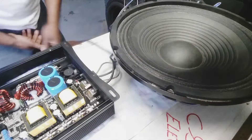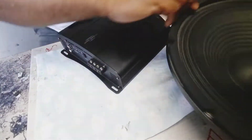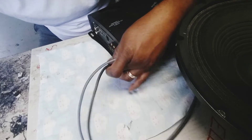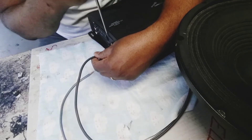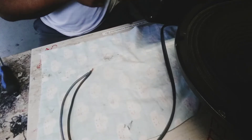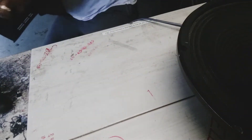Alright, let me set this up here. For bench testing — I know you guys want to see me adjusting the knobs and making sure everything's okay. The speaker wires are right here, so I can definitely hook it up. You can see it has four terminals but they're connected to the same inside, so don't worry about that. I'll use one at the far end and the other one at the first. These wires left in this thing can be a real problem — I've gotten amplifiers with a bunch of them and they shot out the amplifier board.